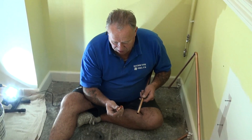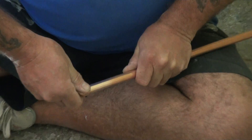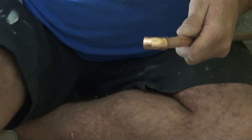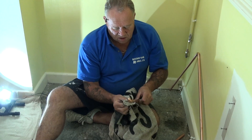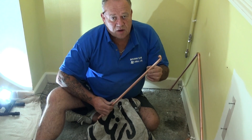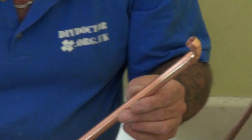Get the fitting that you've coated and push it into the pipe, then twist round a couple of times. You'll find that it's bonded pretty well. Grab a cloth and wipe the surplus off, and you have a really neat joint which in seven minutes will be completely waterproof - an excellent way for the amateur to join copper pipes.